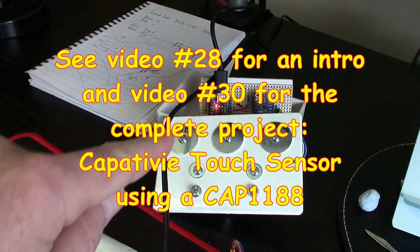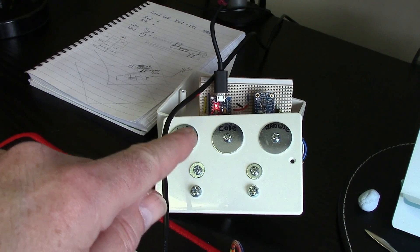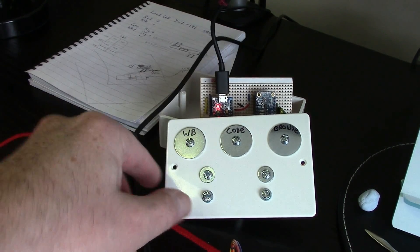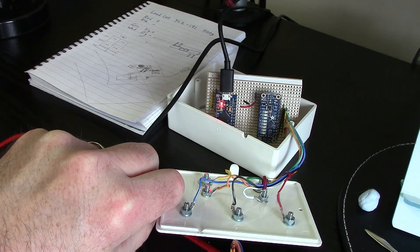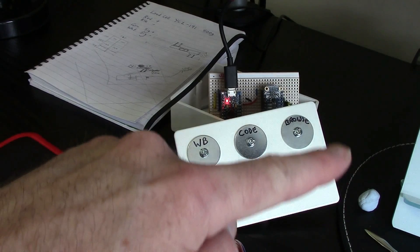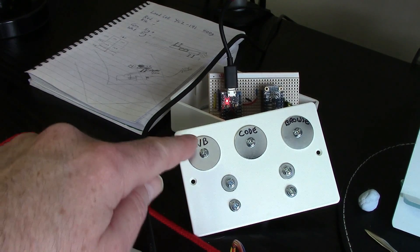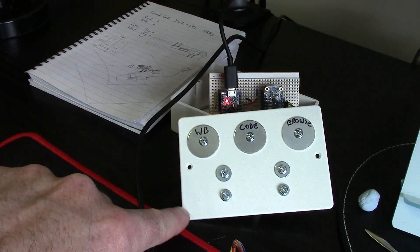I haven't actually gotten around to changing the front panel yet, although I did have a very good suggestion from one of the contributors on my channel. He said to put washer-type things behind the panel so that behind it would look as it is now, but with the washers covering the solder tags, leaving the front panel entirely clear for a printed label or custom front panel. And this plastic does not prevent the capacitive effect from going through, so that seems like a brilliant idea.